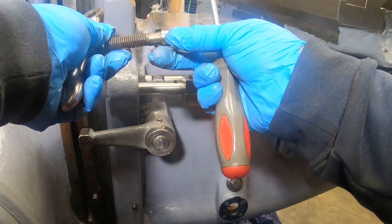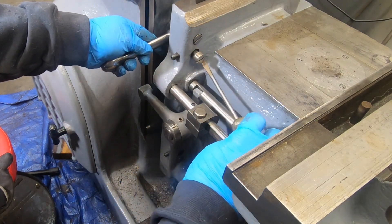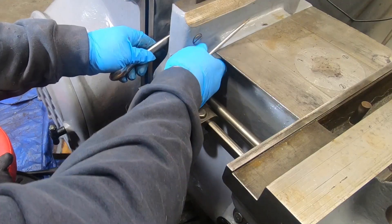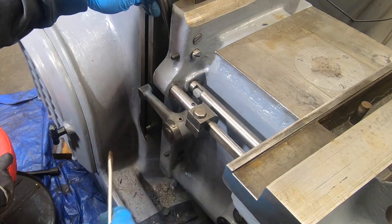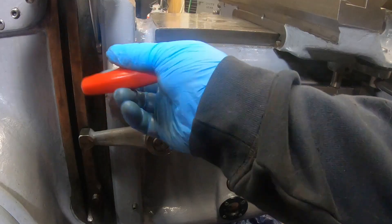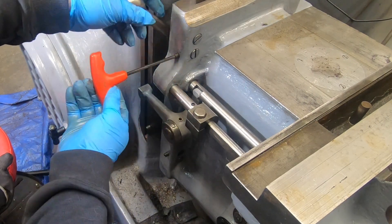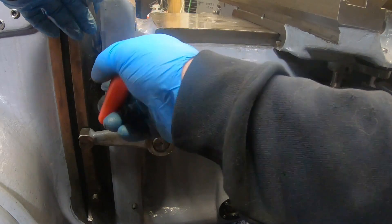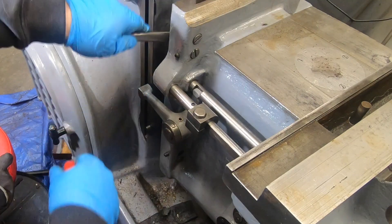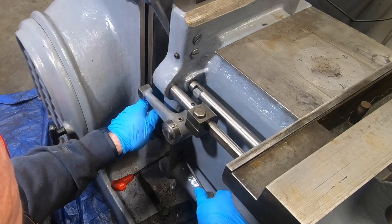While I am over here I can go ahead and reinstall the knee clamps — there are two of them, one here at the top. It consists of a long phillister head screw and a lever that it screws into. Once I get this almost tight I want to seat the screw with a set screw; there are flats on the big screw and once tight it keeps it from moving. The lever then threads on a little further, which is what tightens the gib up into the dovetail.